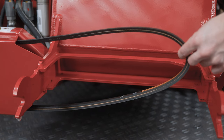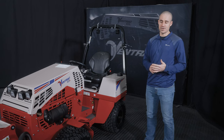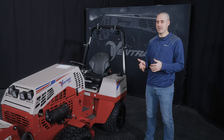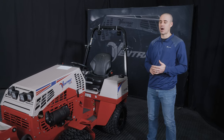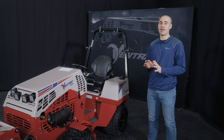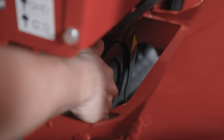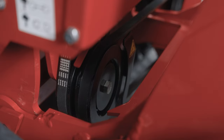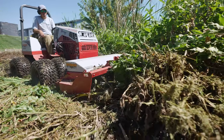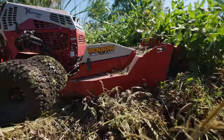The most common request or complaint that we get from customers in the field is of belt breakage. And I'd say at least half the time, if not more, we dive into it and it's a really quick, simple fix. It's, oh, I'm not using OEM belts. And on our machine specifically, that's very, very critical. We spec belts that are of the absolute highest quality, and that goes even beyond ratings. So a belt that we have as a drive belt on a demanding attachment might even stack up technically identical to some rated belts that are sourced from industrial applications somewhere else.